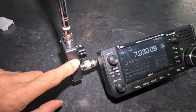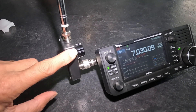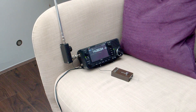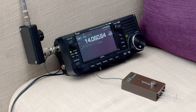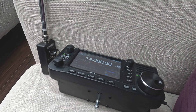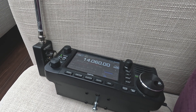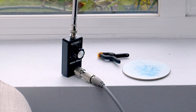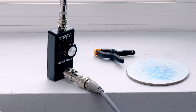As the unit is fitted with a PL259, I had an adapter to convert the IC705 to an SO239. You do need to put a bit of tape around it to stop it rotating, though I'm sure you can come up with a better idea for dealing with that. The ultimate test was inside my conservatory on a sofa, and I had a QSO with a German station. I also found that you can remotely mount the unit with a short length of coax cable to put the antenna in a slightly better position. The thing I like about these little units is that you can carry out all sorts of experiments — you don't have to use it as originally intended.